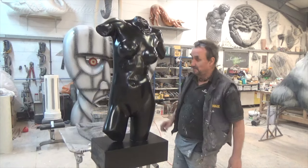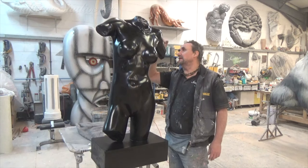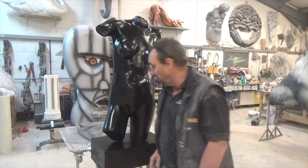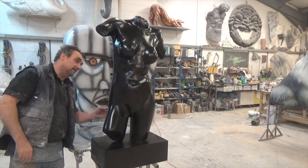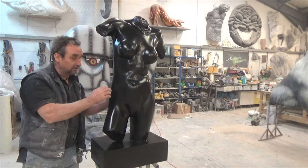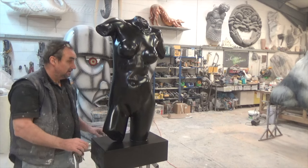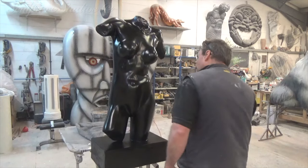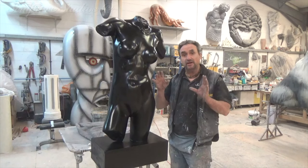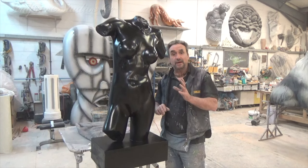I've been over this figure now about seven or eight times. Still a few more little pinpricks in here — little spot holes we need to touch up — and just correct a little bit more on the base. But she's looking quite nice now. This is a really heavy primer filler. We've done it black just in case it gets scratched and there's black underneath the actual bronze. It's taking shape. The more I look around it, the more I can see just very, very small imperfections or scratches. But I'm going to put this under that really bright light before I go ahead and do the bronzing, and then work down to about 1200 wet or dry. That's coming along.